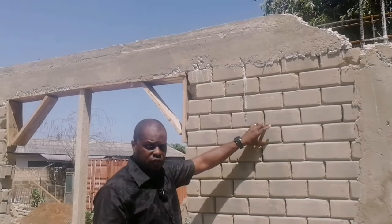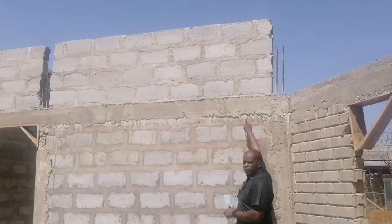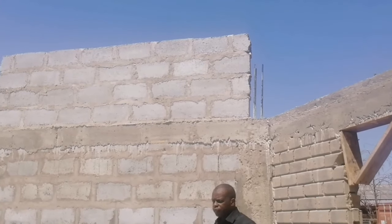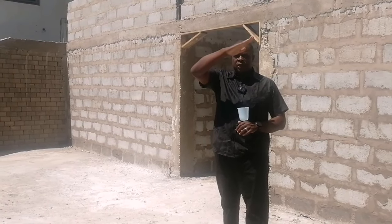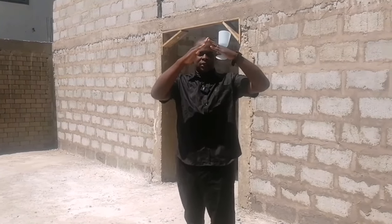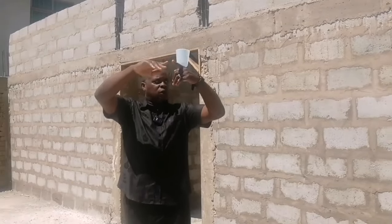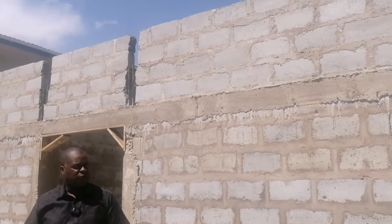After this, what's the next phase? Because we needed the lintel for it. The phase after the lintel is the block over the top. So I was asking Builder Busby - how many courses of bricks are we going above the lintel? It depends on what you're doing. We're doing a hidden roof, so it's a one-pitch straight - not two pitches. A traditional house that you draw as a kid is a double pitch, a two-pitch with the top like that. But we're doing a one-pitch, so all the water goes from the top, front of the house, down to the back, and into your drains.